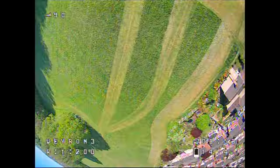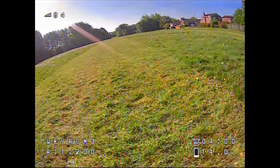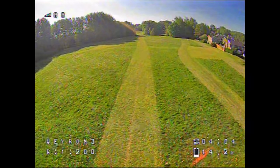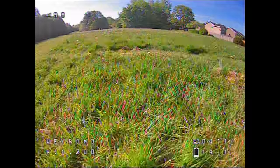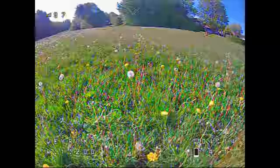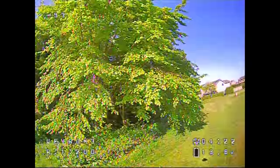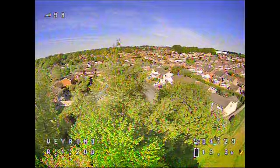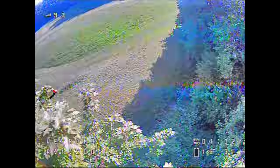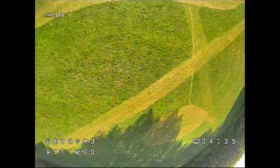12 volts — we have turned this 4S into a 3S, not good. But you can see it is behaving when it's doing acro. You're not really meant to fly these in acro, but if I was to recommend a model to somebody who wanted those protectors just to be safe but they wanted to move on to something like a 5-inch or do acro, then this one is pretty safe — no complaints. The battery is getting very low at 13.7V, and at 0.4 we should really be landing, but look at that — we are at 4.5 minutes flight time, and diving the trees is no problem. But I am running out of power — and even does a cartwheel and doesn't get upset.